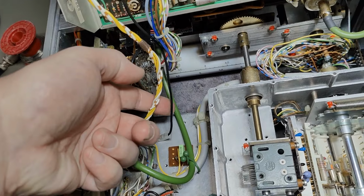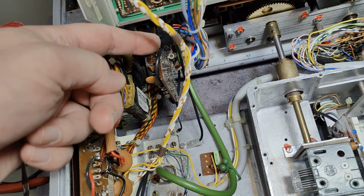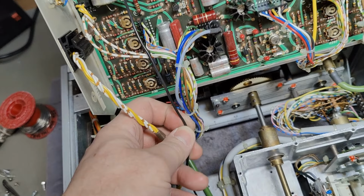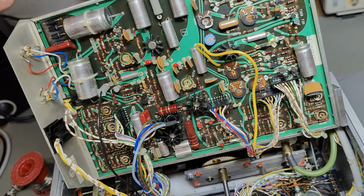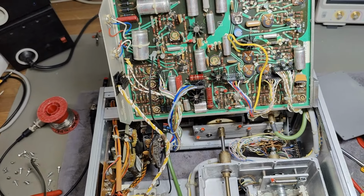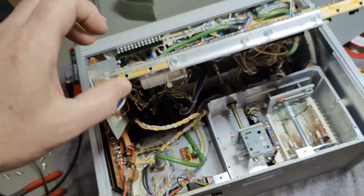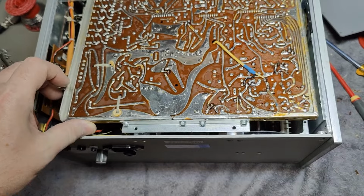Meanwhile, I also found this black wire is just a chassis connection. It went behind this circuit board and behind some components, so I had the idea it was connected down here, but that was not the case. It is supposed to go like that. So it is, of course, possible to have it powered up and still be able to access everything from both sides. Very, very service friendly unit. I really like when people design products definitely designed for service. So I'll try and put this down again. I think I'll leave this box open for now, and let's go and look at the other side.